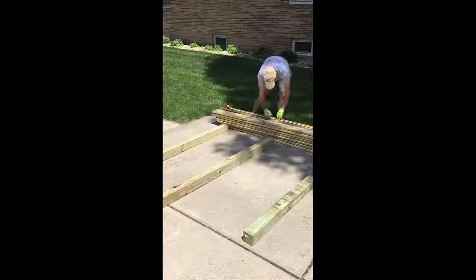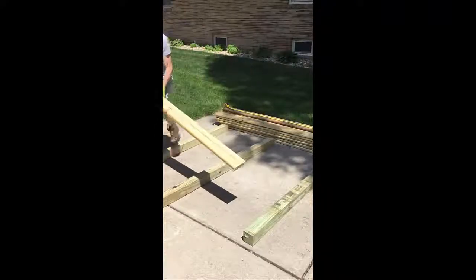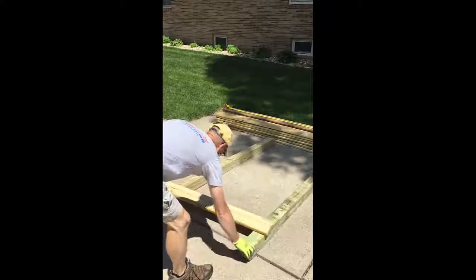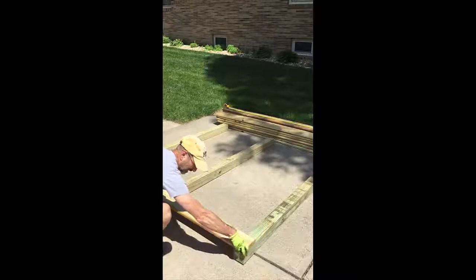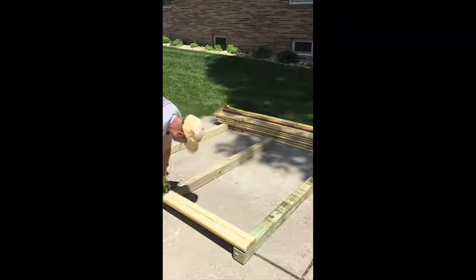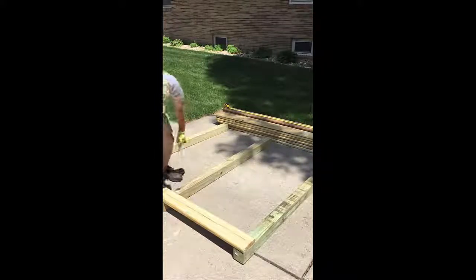I'm not a carpenter and I don't have the skills or the patience to make this perfect, so I'm using my lumber mill cut ends and edges to square up the corners. I put a deck board at each end and make sure the middle timber lines up with the marks I made. Turns out my deck boards are not all exactly the same width, and I'm going to have about an inch overhang once they're all in place. I keep my square corner on one end and just let the other end overhang the whole inch.